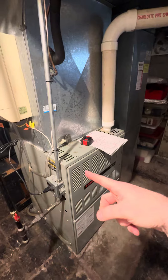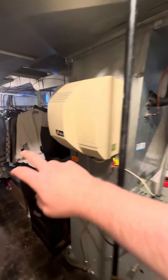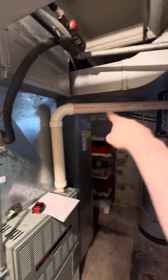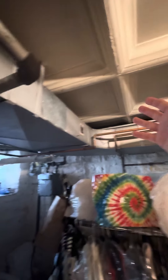We've got a D-width furnace, 40-inch tall, D-width coil, and a powered humidifier — we'll do a bypass humidifier here. It's a single pipe, which is the tricky part for this house. It's not stick frame; there's no wood — it's all concrete.